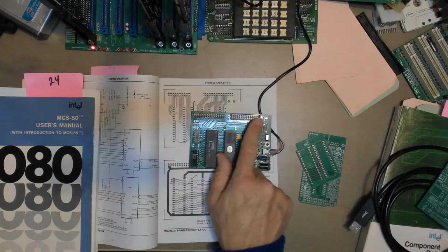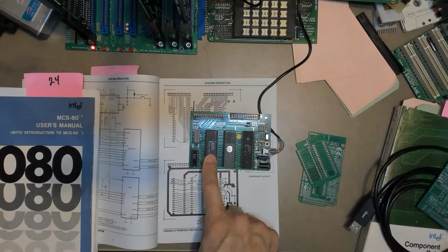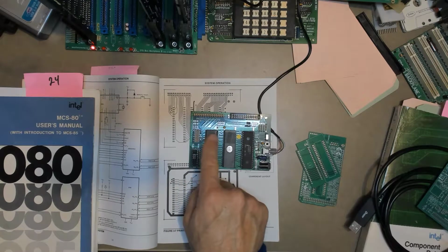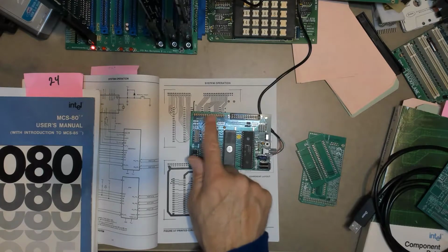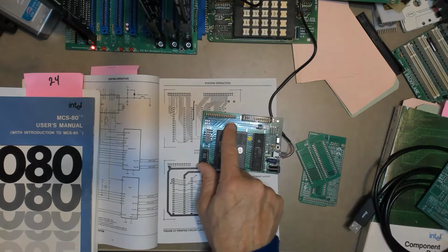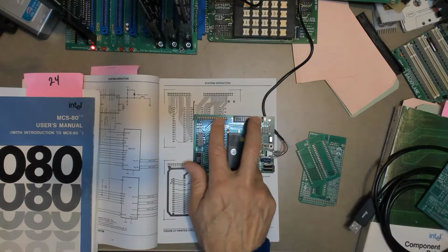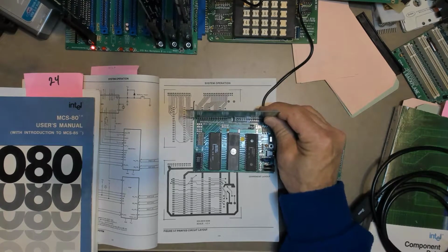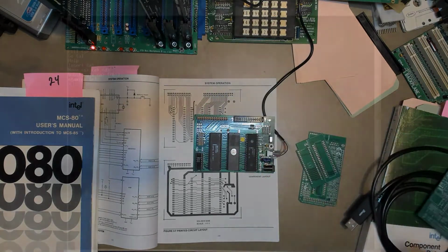So the I/O is across the top here. There's one for the 8755 and the other for the 8156 I/O ports. And then also you can see there's some little breakout and patch panels here. So if you want to bring a signal like the interrupts or the timer in and timer out to these headers, you can use patches and wire wrap it into the off-board connectors. And I think what I'll do is I'll probably make another little daughter board, a project board that plugs into the back of this, maybe a real-time clock or something, so I can have this sitting on a nightstand, and a nice little real-time clock display on this. Not sure what I'll make yet.